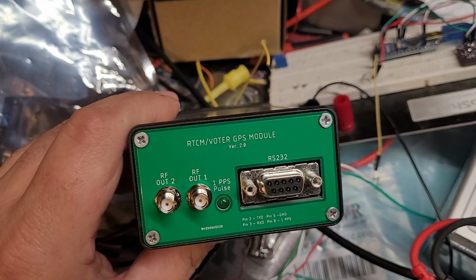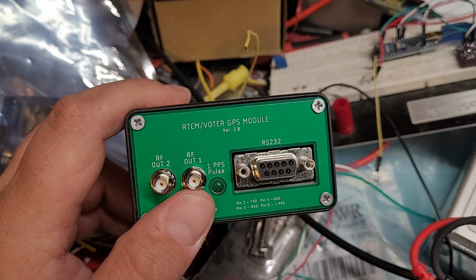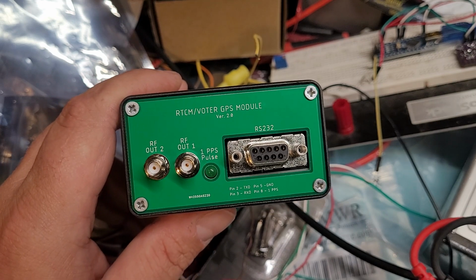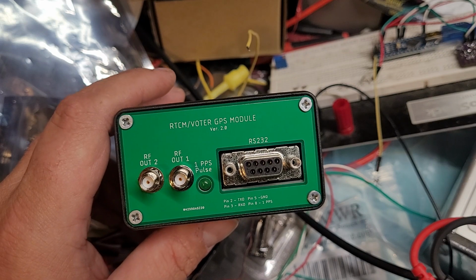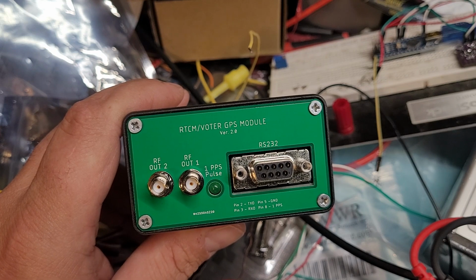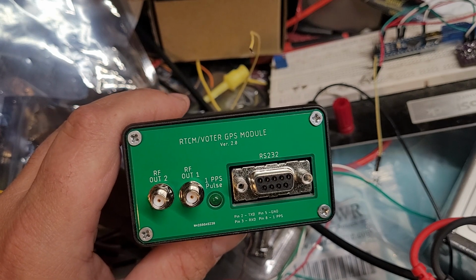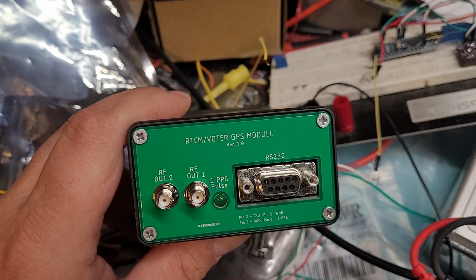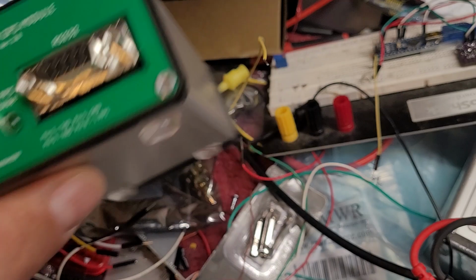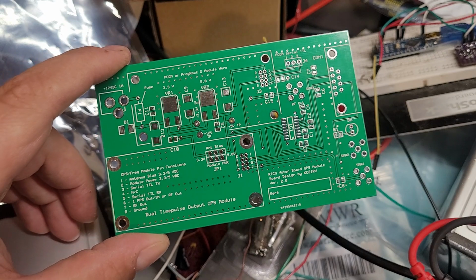This one right now is programmed for 9.6 on the second output and 14.4 on the first output, because I'm going to be putting this in as a replacement at my one site, which uses a modified MaxTrack as a transmitter. But if you're using something that used, say, 16.8 for a reference, or 12.8, or 10 megahertz, you could use this. And this would provide the RTCM with everything it needs, as well as the reference for your simulcast transmitter.